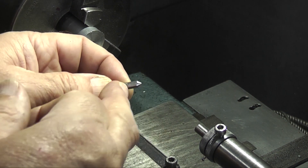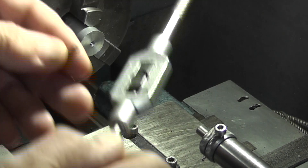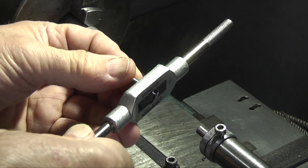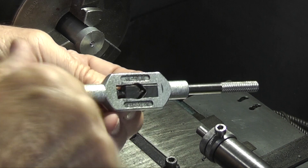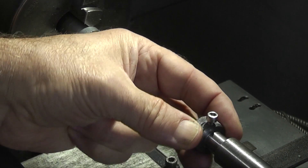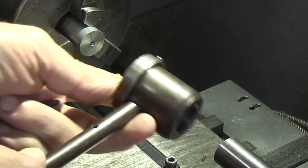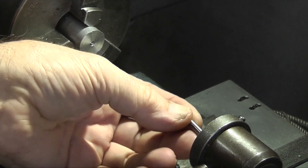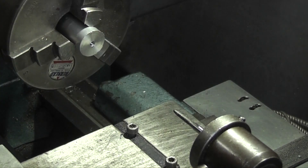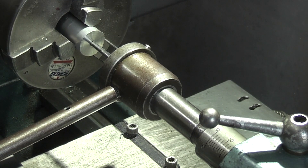On some taps there is a point but on some you have a centre. This fits into the spring loaded centre device to guide it, but I also need the tap wrench on the outside. I find that when you put the tap wrench on there's hardly anything coming through to locate in the centre. So as I use the same guide bar for dies by using this die holder on the end, I've made the square hole that fits over the end - then the tap just fits into the hole. It doesn't need to be tight, it can be loose like that so it can line itself up, and as I bring it into the hole it lines itself up and I'm ready for tapping.